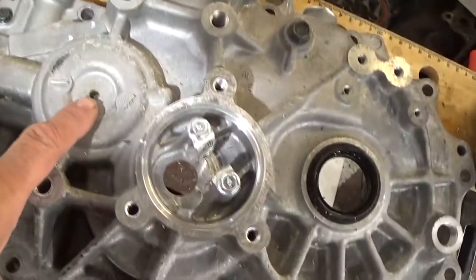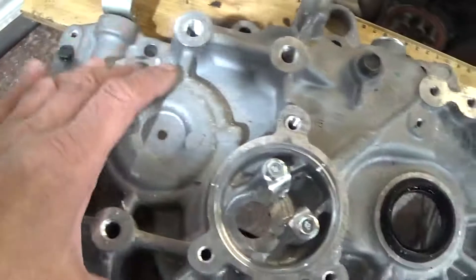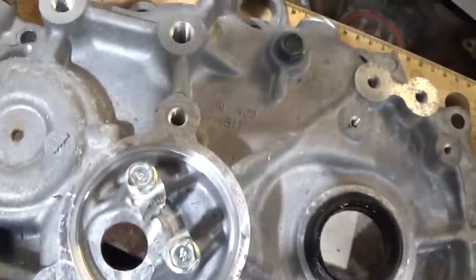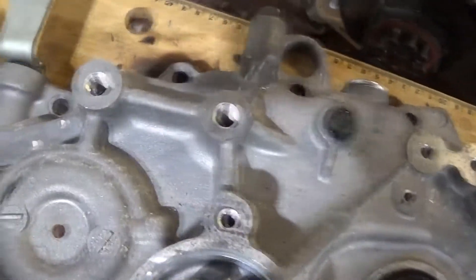So let's see what I'm going to do next. Moving on, I'm going to use this as my template — because of the bolts on the leaf gearbox you can't get to the other side to punch them through to make indentations. I've got a tank cutter, I'm going to cut that hole out to give me my approximate centre. This doesn't have to be exact — this is going to give me my hole fixings which I'll tap through for the mating on the gearbox on the other end. I'll double check where the coupler sits before I start drilling all the holes out.